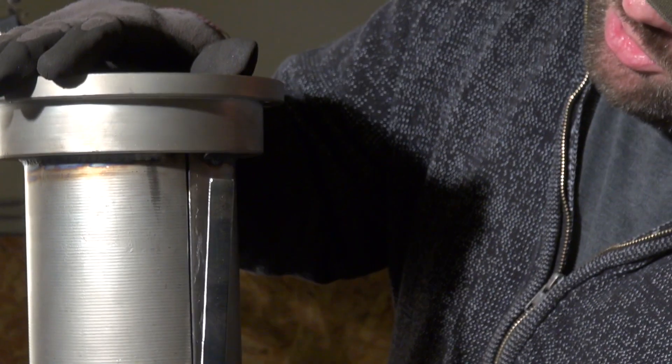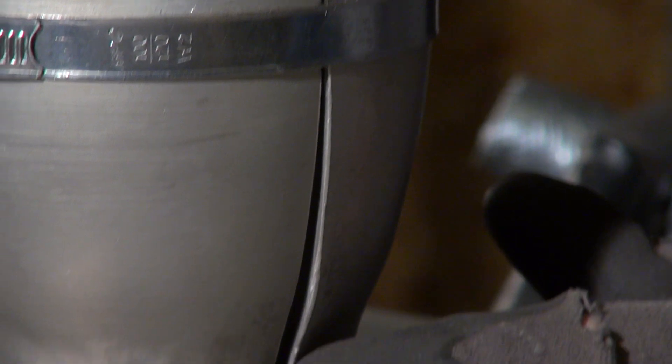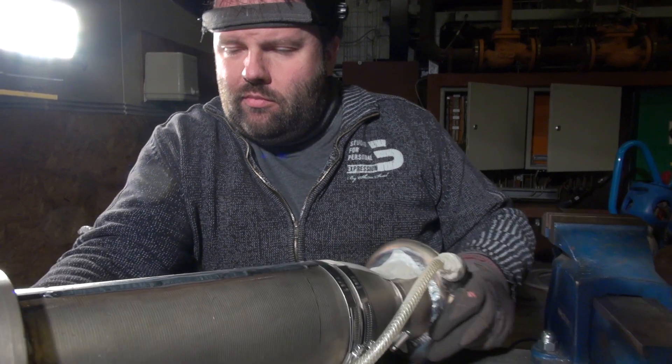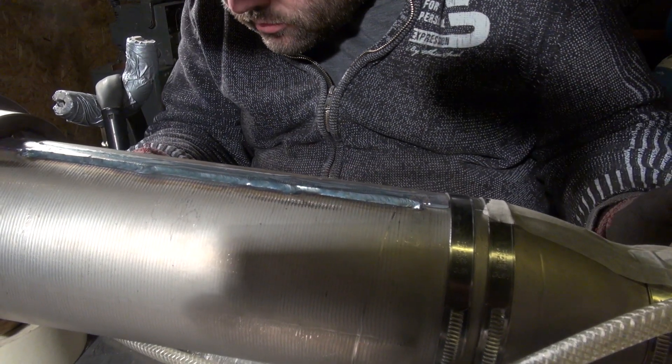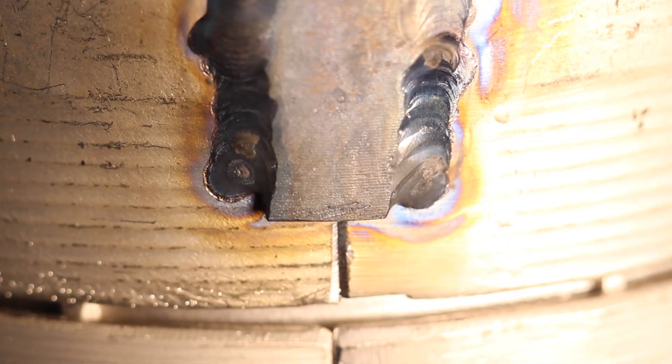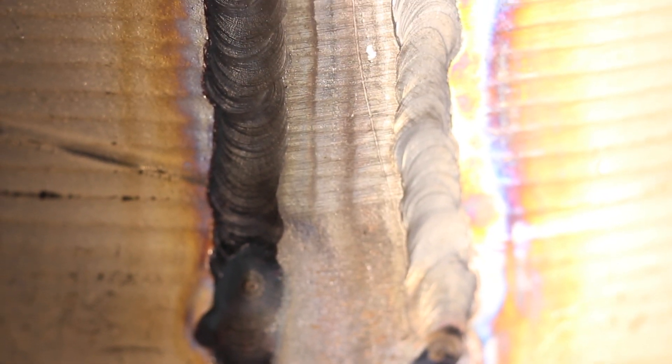All that's left to do here really is to close up this seam here. I already have a piece of material which I'll simply stick on the outside and then just weld it in place on either side. It's a little bit risky to do a welding of this seam without additional material. In order for this outer liner to cope with the fuel pressure — probably around 25 bar — I need to be sure that I get a weld which goes all the way through the material.